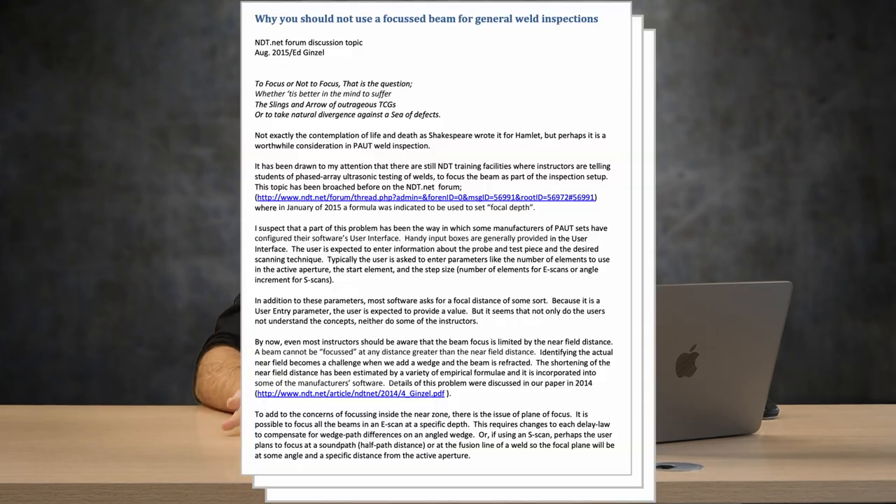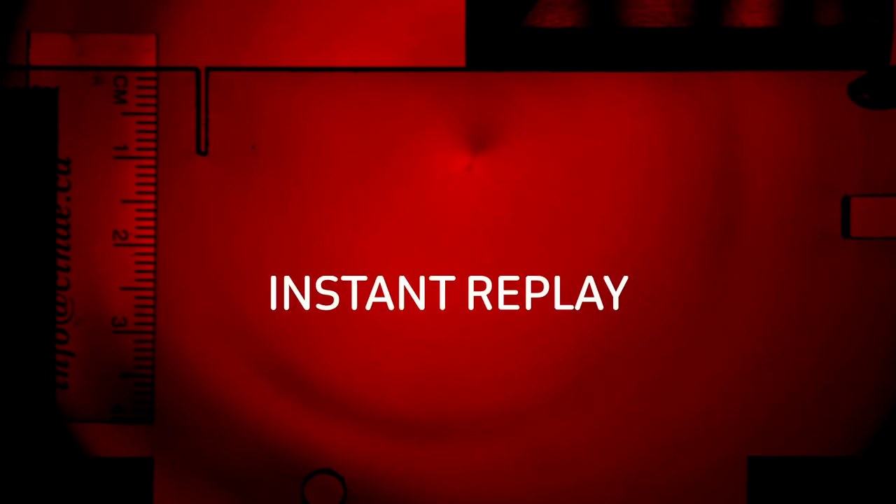For a focused beam, the rule of thumb is to focus at a true depth of 1.5 times the part thickness. Now, this doesn't always work — there is a good paper available on NDT.net from Ed Ginzel to show you why — but a lot of the time we do get away with it, so let's try that first. Here's what one shot looks like at 55 degrees when we are focused at a depth of 15mm. See the beam kind of get narrow, really tight at that 15mm spot, and then it expands after that. It's not that big, flat, parallel wavefront we saw in the unfocused beam — you only get that when you have the same delay applied to all elements.